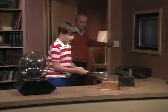Whoa. See how much that happens when the lights go off. It's filling it. You're sending very high frequency electricity through the glass, which is something like over there, but then you're also sending it through the gas inside — and it's probably nitrogen inside that light bulb — so you're making the gas glow. If you hold it right there for a while, the high energy of the electricity is strong enough to actually burn a hole in the glass. See if you can tell me when you've burned a hole in it by watching the color of the glow. Now you see you've burned a hole in the glass, and you notice the difference in the color of the spark on the inside? Yeah, before it was sort of a purple-y blue, now it's orange. We're probably adding some oxygen in there, so that's glowing as well. So that's the general idea of what's happening inside the bulb.